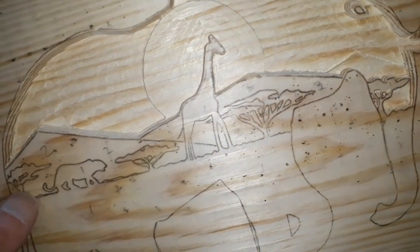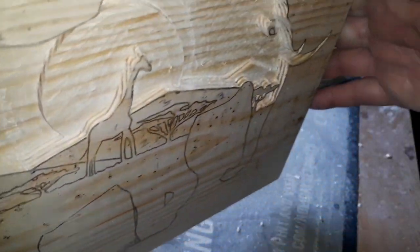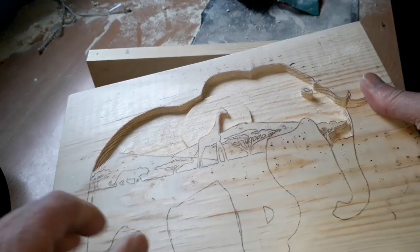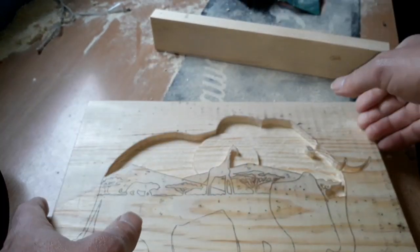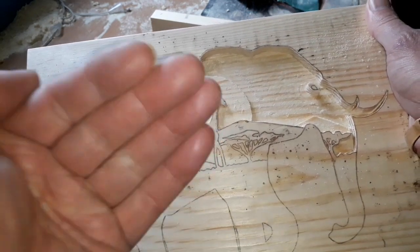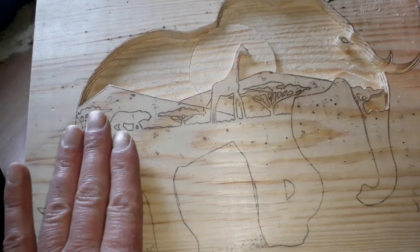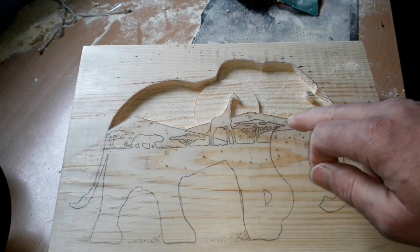We've done our four, as you can see — just round the tree there, around the giraffe's neck. It's got quite good thickness to it, but I still want to get a three, a two, and a one out of that, so it might be a little bit tight but we'll continue. We'll raise the CNC bit in the router up again, set it to our mark at three, and take out number three — going round the giraffe's legs, which is going to be the hardest bit, and round that tree. Then we'll raise it up again, do the two, and the final one — which will actually be the easiest one, even though it looks more complicated with all the animals around it. It'll be a case of lowering it down by one and just skimming over the rest, because we've already taken out all the backgrounds. So let's do number three now and see how we get on.